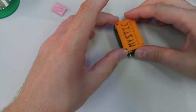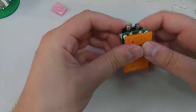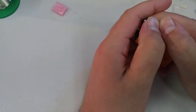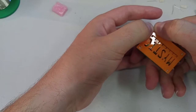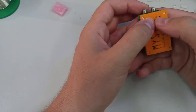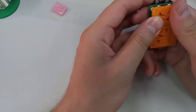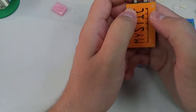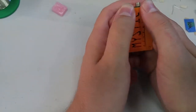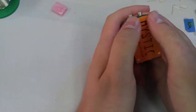Then we got our acrylic backing. We'll just go ahead and make sure it lines up with all 4 holes before we start putting it in there. Now what we don't want to do is apply all of the pressure to one corner at a time. You see, like I'm monkey wrenching this entire thing, just throwing it all over there. That'll potentially crack this part of the acrylic backing. They can take a lot of force, but not full human hand strength to one corner force. So what we like to do to even out the pressures, we just take both sides and, like an ocarina, we just hold it, snap them both in at the same time.